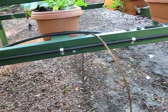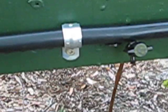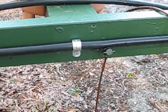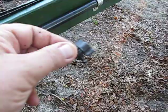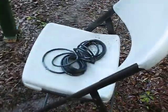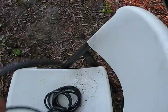I attached the main line to the bottom rail with some galvanized conduit straps, secured with pressure-treated screws that have a square head. Then, as it goes to each leg, I've used a little valve that ties into the main line. Off of that, I run a secondary supply line, which is this flexible rubber tubing.